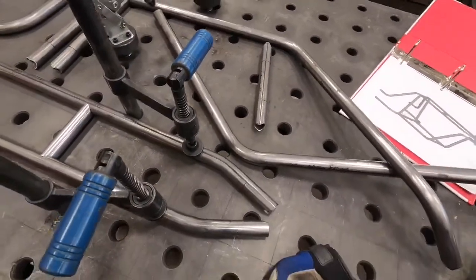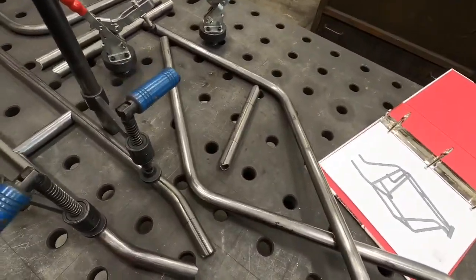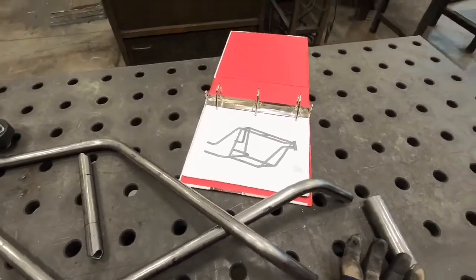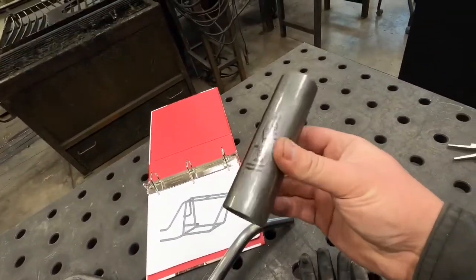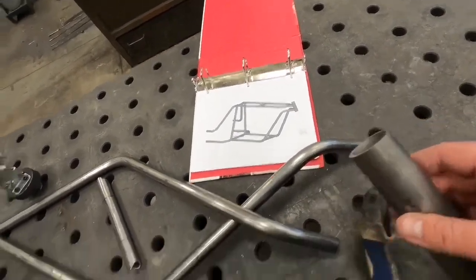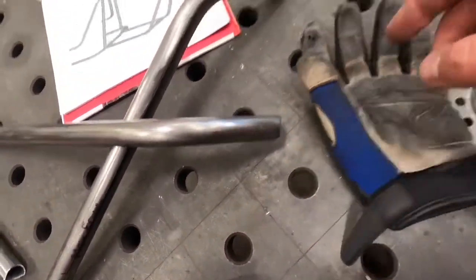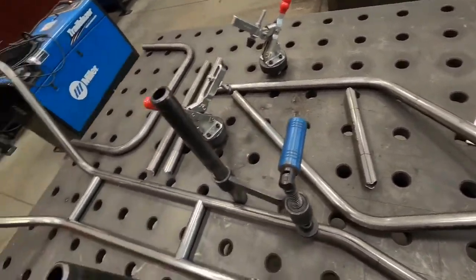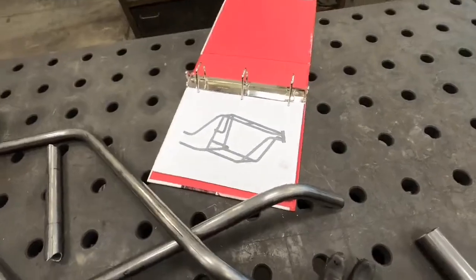As you may notice, once you get it out in the real world, things can change. I noticed that the head tube I'm using - I'm actually taking the head tube off that scooter - it's a little bit bigger than inch and a half, which is what I put on my print for reference. So I know already that I'm going to have to open these up, so they're not going to fit perfect. But those are little unexpected things that are hard to plan for, so you'll just have to think on your feet when you're out in the shop.